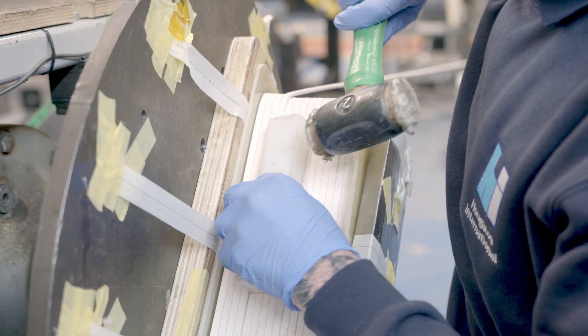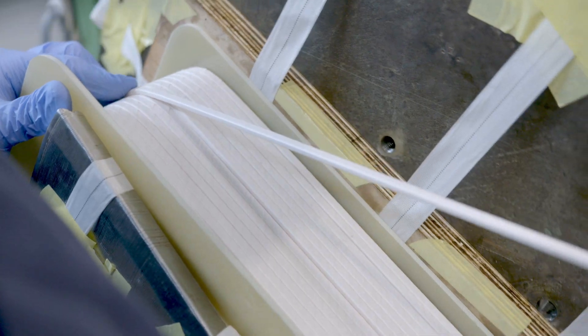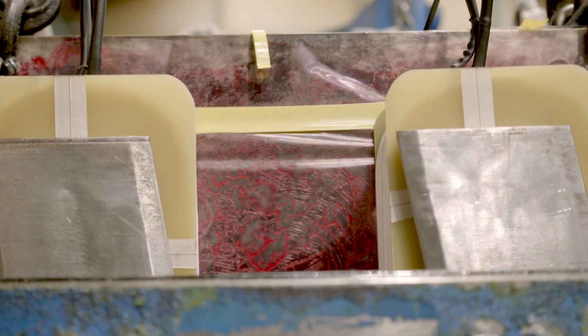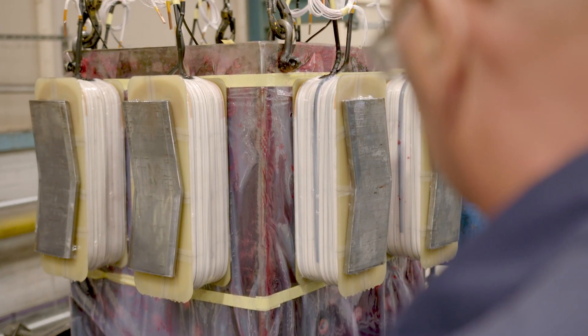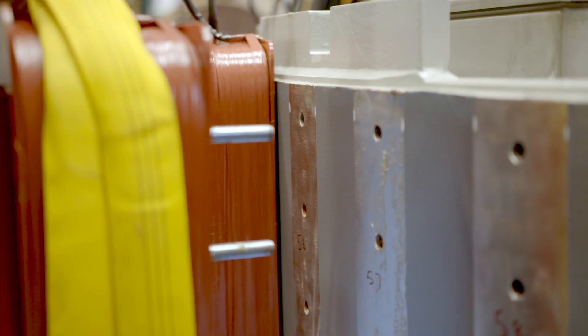We do have quite a lot of products that are proprietary to us that we've used within this project. We've developed our own system for rewinding the DC pole shoes of the rotor — that's been developed on the high-speed train product, which we've done hundreds of and they're all out in service still. We've run them through a VPI process in-house using an epoxy varnish. This gives it a really strong finish, ensures the varnish is deep throughout the coil, and also weatherproofs the coils very well. It's a proven, tried and tested system — it's running on trains, seeing weather, moisture, and temperature changes, and it's proven to be a very strong system.